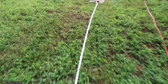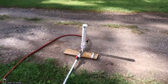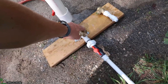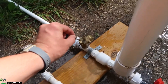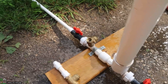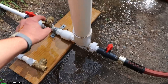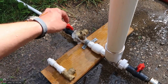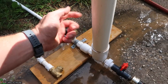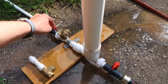First I want to make sure there's no air in the drive pipe, so I'm going to open that. Water rushes down and snaps the valve. There's a little debris — looks like a leaf in there. That's all it takes to hold it open. So I'm going to cycle this valve until it starts working on its own, since I've got the delivery closed. I may still have a little air in here. As I cycle this, it's building pressure in the pressure tank, and as soon as enough pressure is built, it will start cycling on its own.